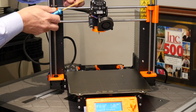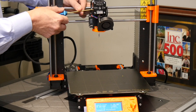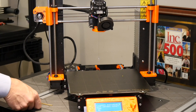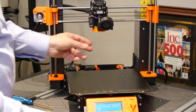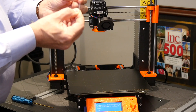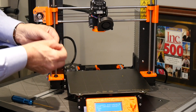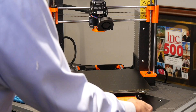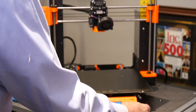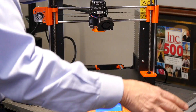I'm going to tighten each of these screws about one full turn. You can see that made a difference immediately. Now I'll pull this filament off and check it — it felt a little thin, so it was probably under-extruded. I'll tell the menu it was correct and unload the filament, and it came out nice and easily.